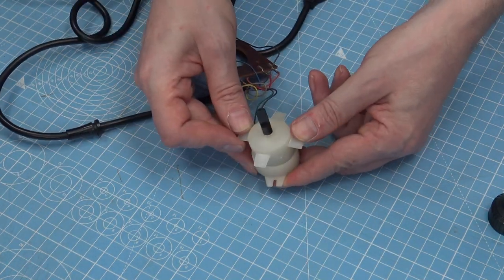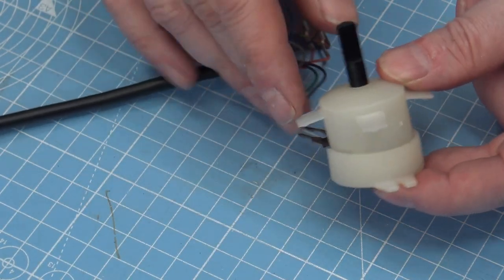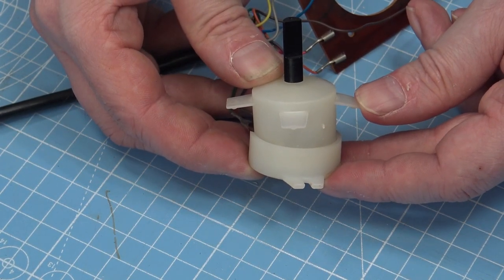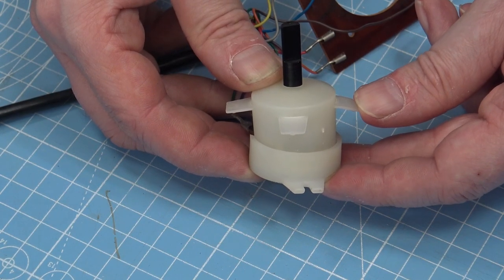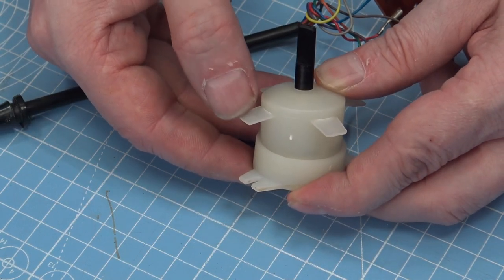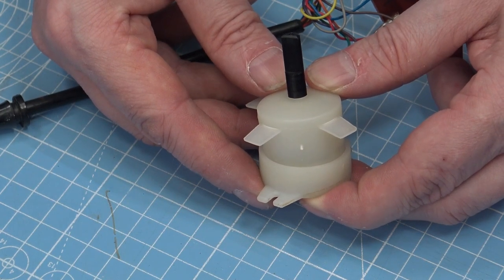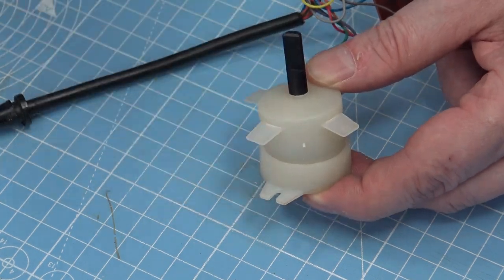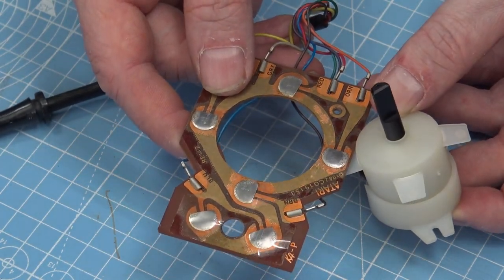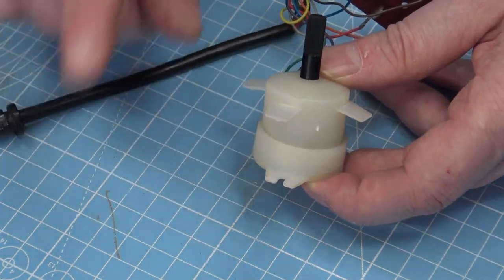This is the mechanism for the paddle. It's made of a plastic that's very strong. These parts here push down on those dome switches, and they're quite flexible but at the same time very, very strong material. I'm not quite sure what that material is — it has to have enough flex for you to move the joystick and push down on the dome switches. Over time, if it doesn't have enough flexibility, they're going to break. So that was my first issue.